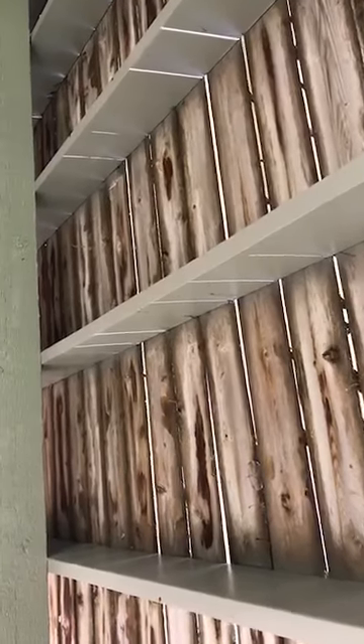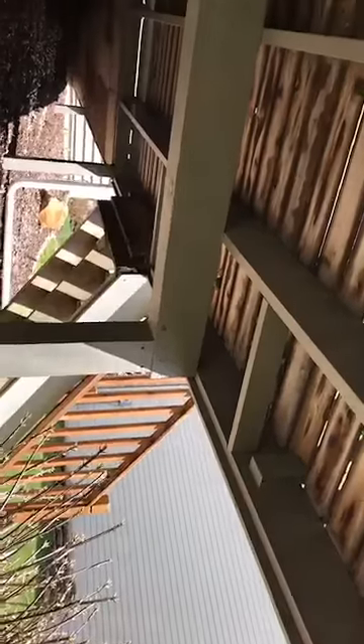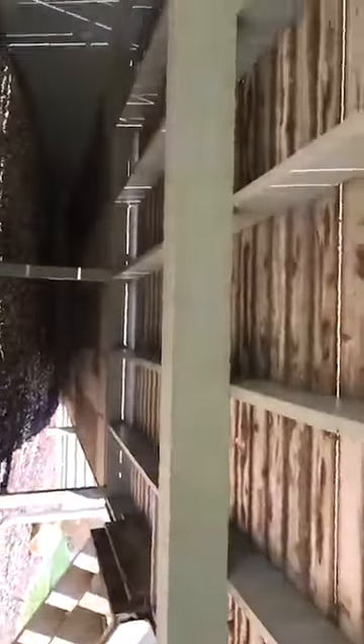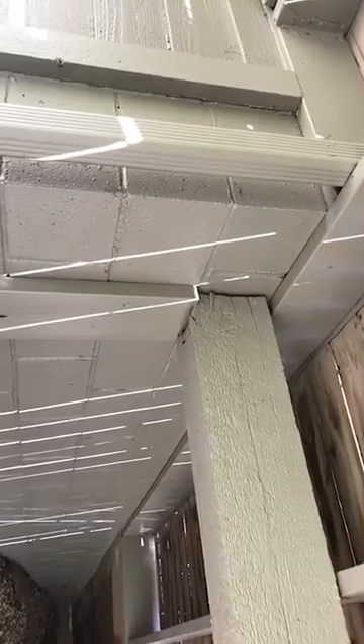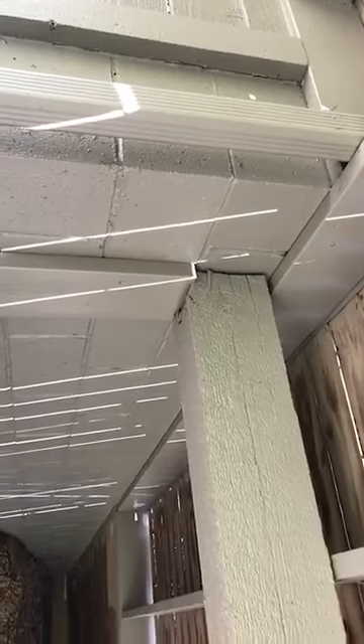So that's one thing. Secondly, we've got a beam here that's sitting on a nice column — a six-by-six beam sitting on a six-by-six column. But over here, when it gets to the other end, it's actually sitting on top of a two-by-12 or two-by-10. So there's very little of the beam that's actually sitting on top of that two-by. And you can see that it has broken and it is sagging.